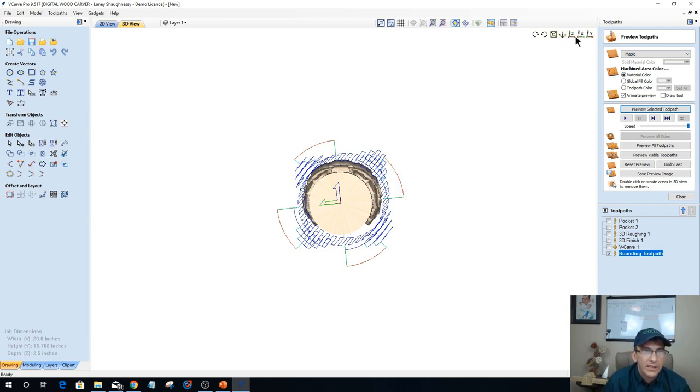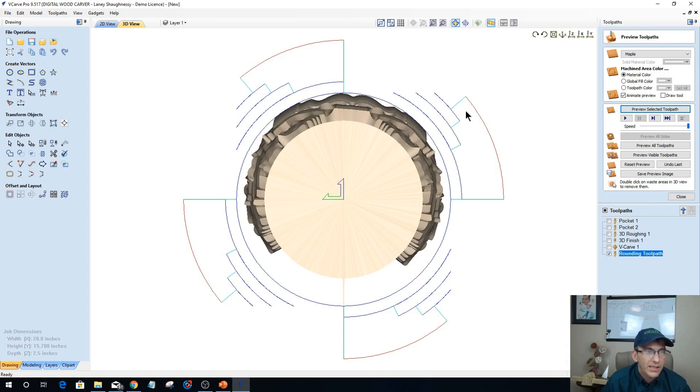If we look at this at the end, what it does is it comes over and knocks off the corners first. It'll knock off this corner, rotate 45 degrees, knock off this corner, rotate, knock off this corner, rotate, knock off this corner. And once the corners are down to the cylinder, then it'll just start to clean up and round that cylinder off and everything. And you can see within my cylinder how close my model is to that edge and everything.